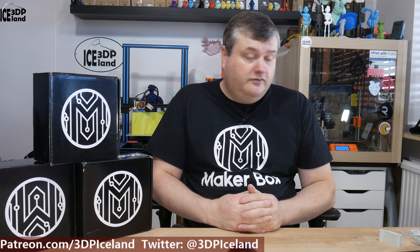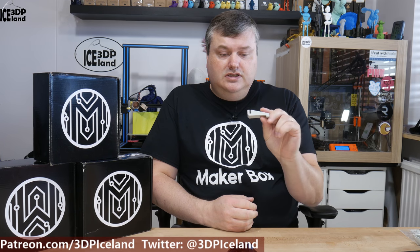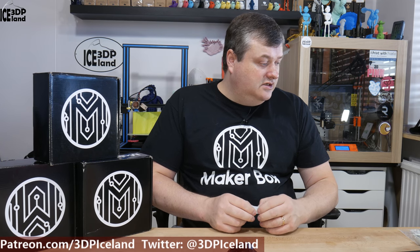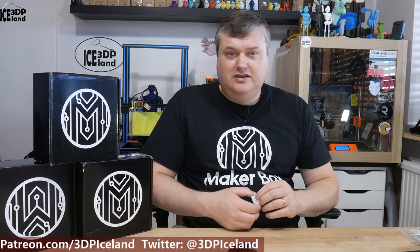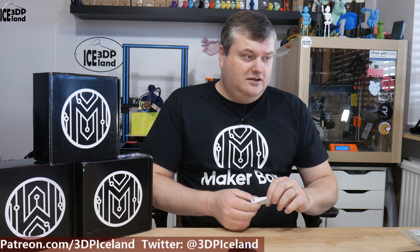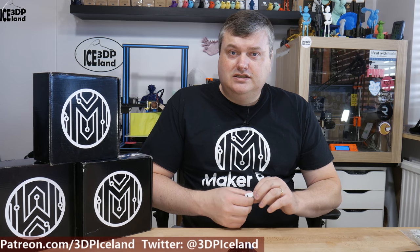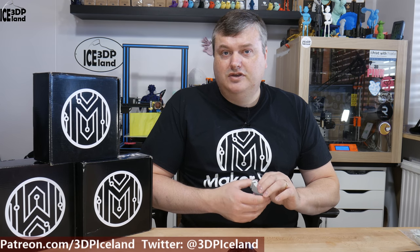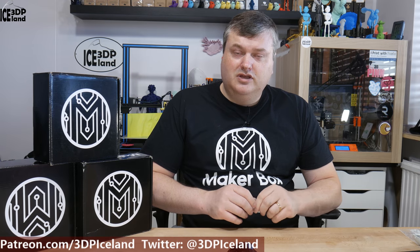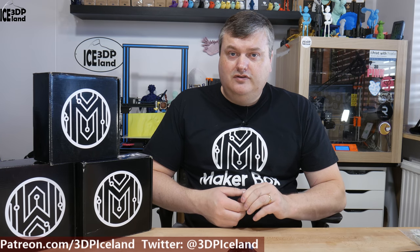For mechanical parts like this one it's a really good option - it has great strength and it prints really easy. They have pretty bold statements about print quality and stability of the material. I haven't done any outdoor testing at this point, but I believe ASA is a good option for outdoor applications because of the UV resistant properties. So it's a good option for mechanical parts that need to be outside, and I would definitely give this filament a go if you have the option to buy it.